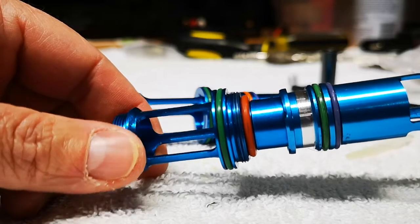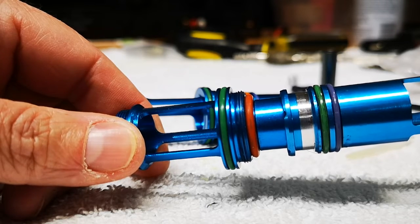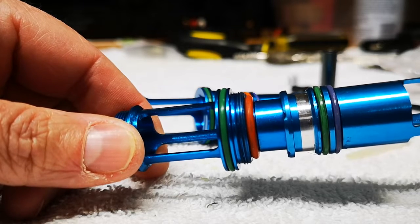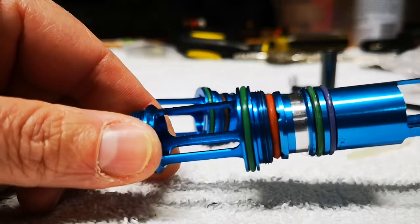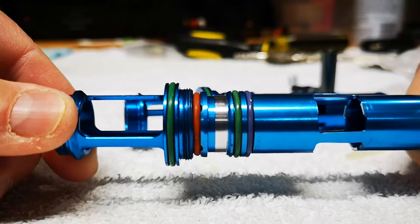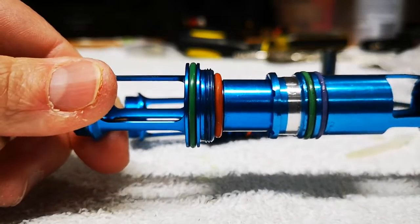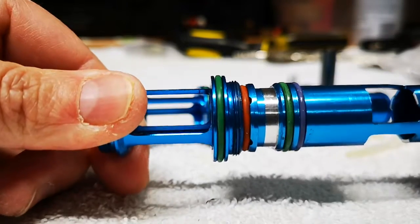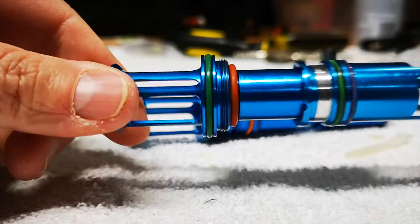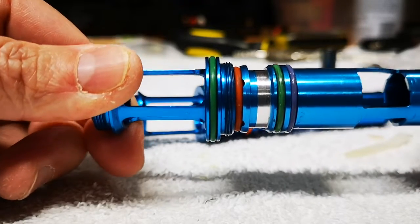The 50 duro is the same size — a 1-1-1 metric size — but this bumper is softer. It's a silicone high-temp o-ring with a 50 durometer, which is quite soft and squishy. As you can see, when I push it, it actually squishes — it's got some impact absorption. When that bolt returns, this bumper actually absorbs some of that impact.